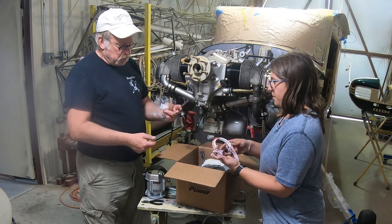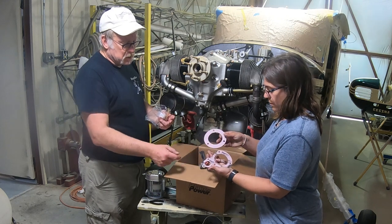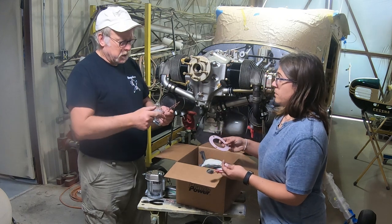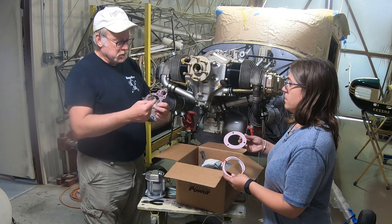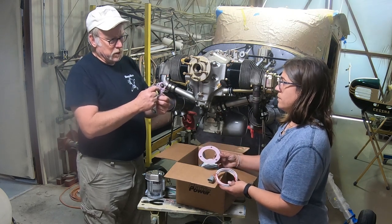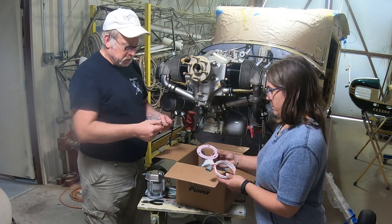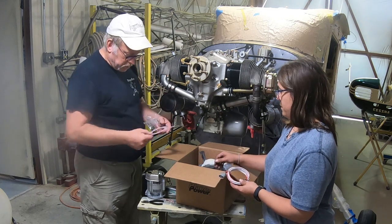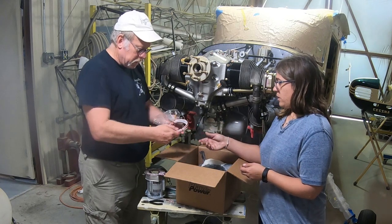Gasket, awesome. You use this type of gasket, or depending on your engine, that kind of gasket. Now, this is real important: don't just take a generator off and then cut the gasket, because on some of your engines, your oil pump idler shaft is right here, and you'll leak oil. So if you have a one piece gasket, change the whole gasket. If you have a small gasket like this, then that's where you are. So don't cheap out.